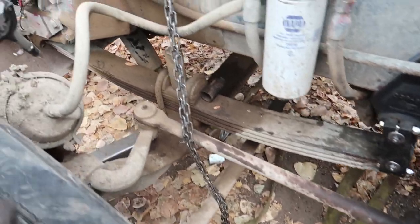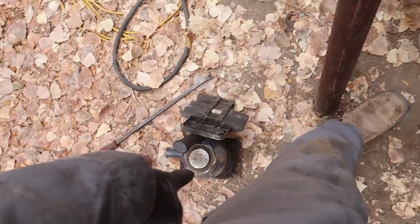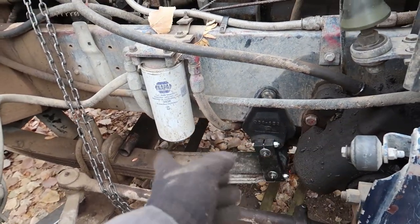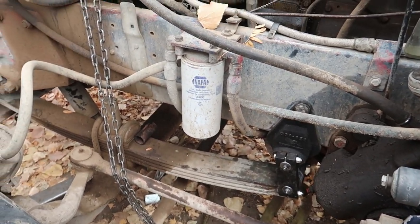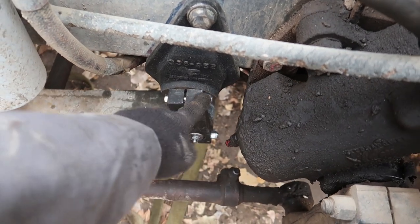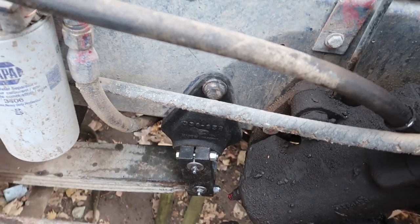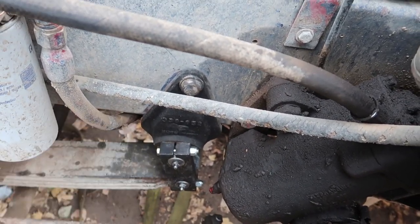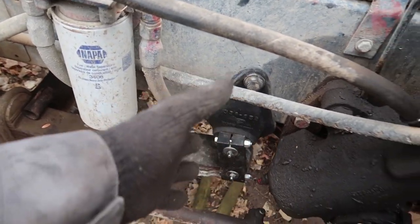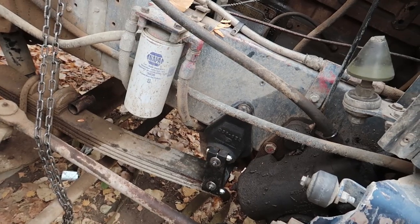This side will be completely done. She's sitting a little higher now. I think the truck's still kind of leaning — this one's loose, and that one isn't even tightened. It makes sense that this side is higher because it doesn't have the worn-out bushing on top and bottom anymore. I'm thinking about pulling these off and throwing red or blue Loctite on them — they really should not come loose, but they do hold the whole suspension together. The lock nuts are brand new so those should be fine. Just for peace of mind I might do it later if I start seeing them walk out.